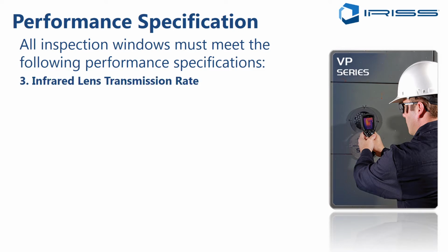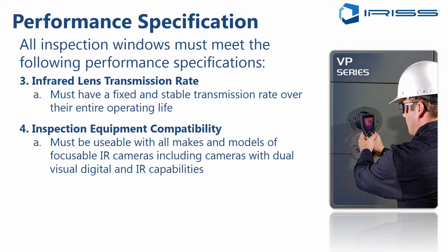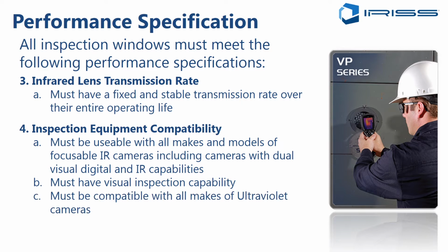So carrying on, you should be specifying that the infrared lens transmission rate be stable and fixed over the entire operating life of the maintenance inspection solution. You should ensure that the inspection equipment is compatible, right? That any window that you're deploying is usable with all makes and models of focusable IR cameras, including cameras with dual visual and digital infrared capabilities. You must have visual inspection capability. A visually opaque window is no good to you if you intend to also use it for visual isolation verification and for visual inspection of other components inside the enclosure. And it should also be compatible with all makes of ultraviolet cameras.